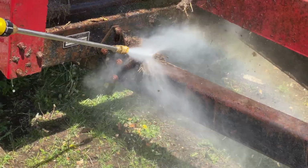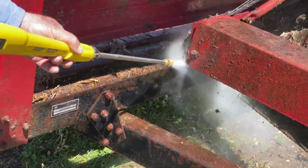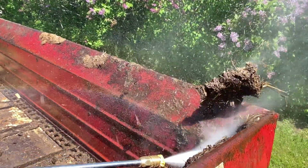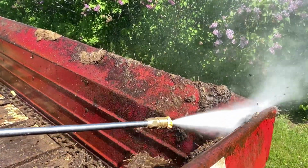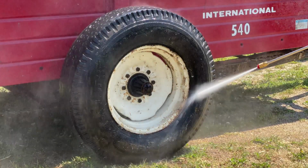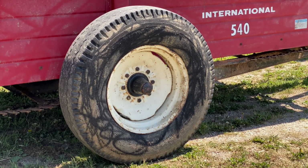Pressure washers are very effective at cleaning nooks and crannies, as well as delivering water up high enough to reach elevated locations without you being on a ladder. Just be careful though. Always test a small area first and then let the surface dry completely before deciding that your pressure and distance details are correct. It's possible that a pressure washer can leave marks behind that only become visible on the surface after it's dried, so make sure you do a thorough check first.